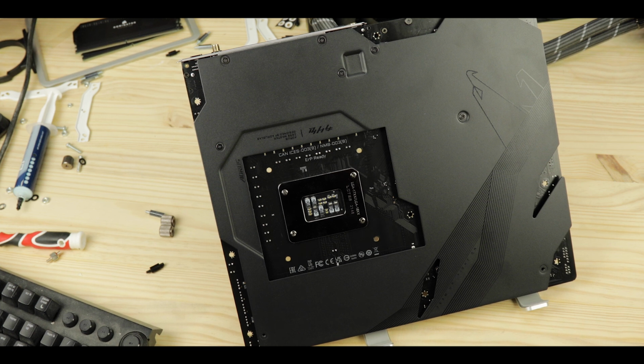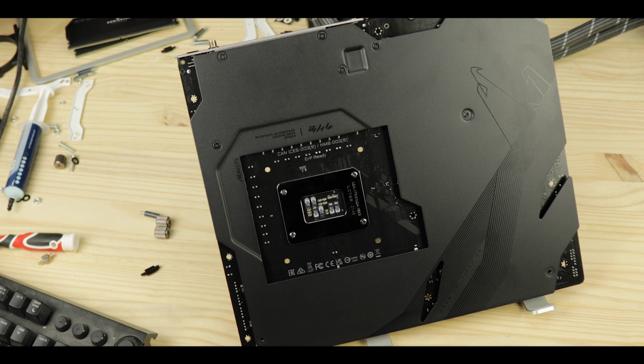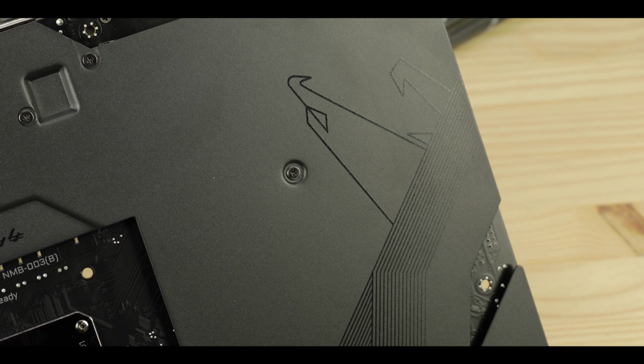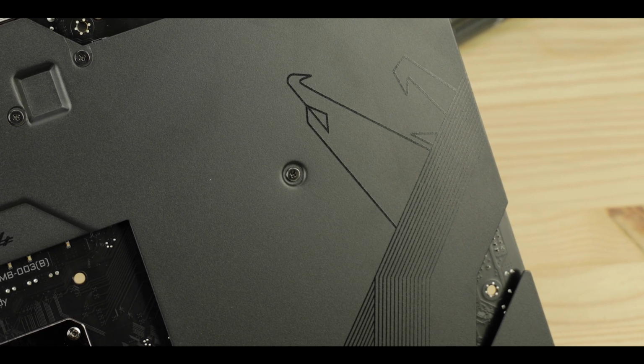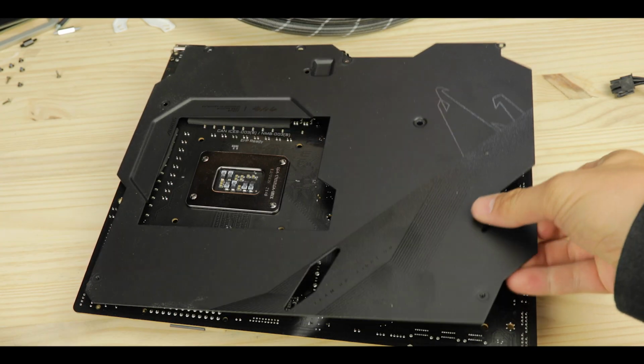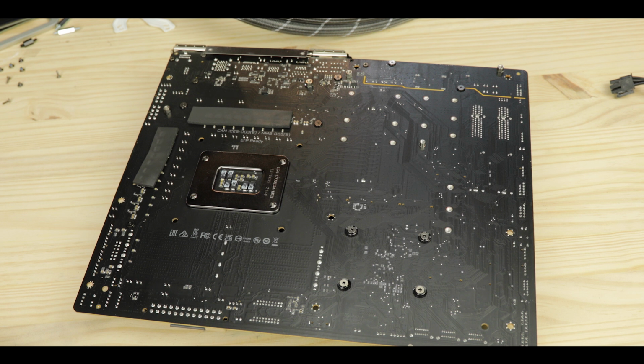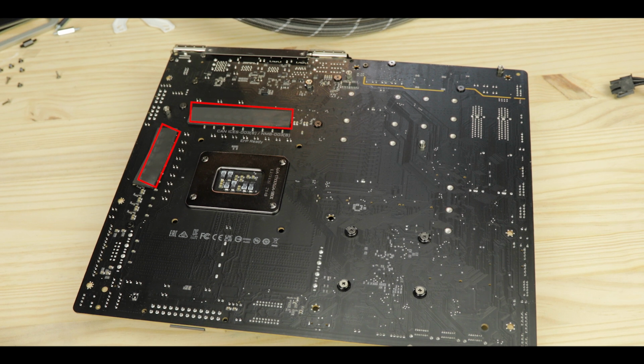motherboard. In addition, and as we see in top-tier powerful motherboards, we do have a massive backplate, which has the advantage of both protecting the board back circuit from indelicate builders, truly yours, but also provides additional cooling to the VRM by providing its solder points with thick 1mm thermopads.